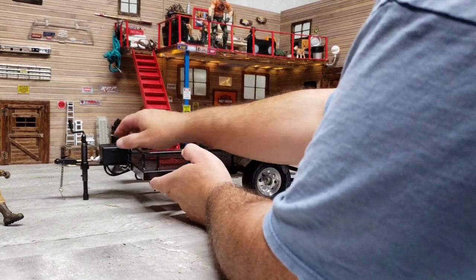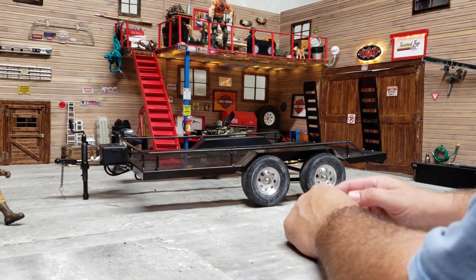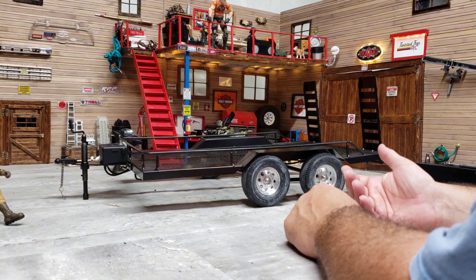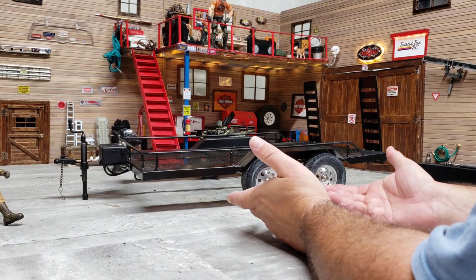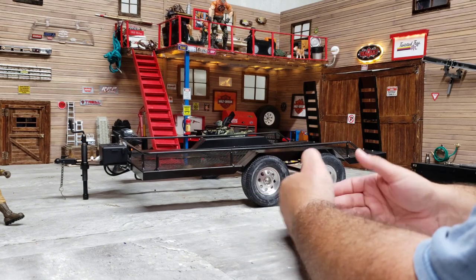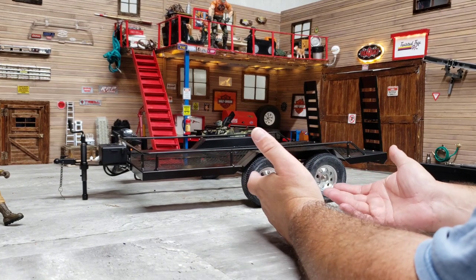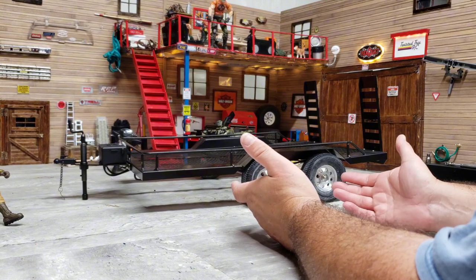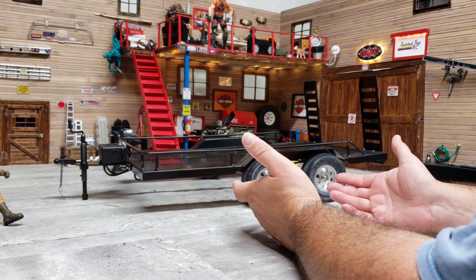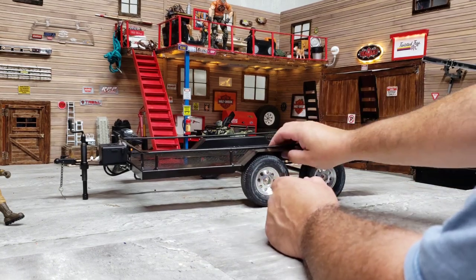This switch was wired wrong from the factory. It was actually shorting back to the batteries in the off position — which would turn the lights off, but then it was back-feeding into the battery pack. So if it wouldn't have been that the battery pack is triple-As, and if it had been a LiPo or nickel metal hydride, that could have been a pretty big boo-boo. I got lucky they were just triple-A batteries.